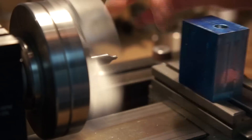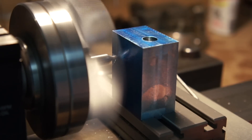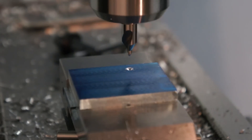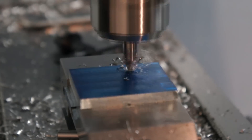In order to get the knurling wheels at the exact height, I put the center drill in the lathe and then affixed one of the knurling blocks to the cross slide and used the lathe itself to center punch it, so I know I'm exactly on center. From that I brought it back to the mill and finished all the drilling operations.